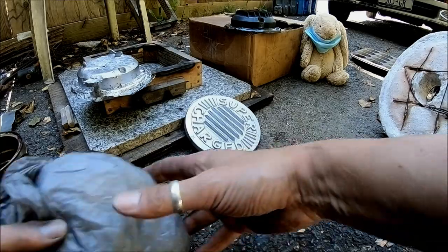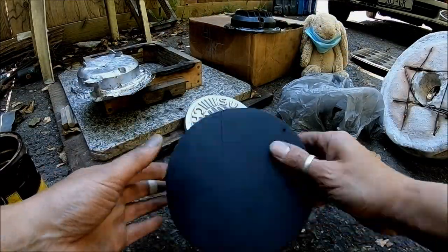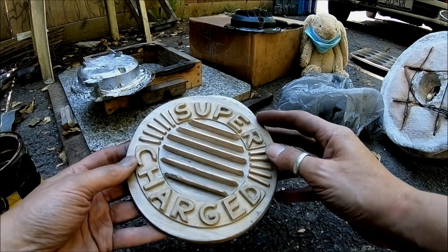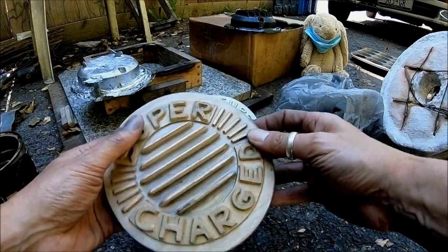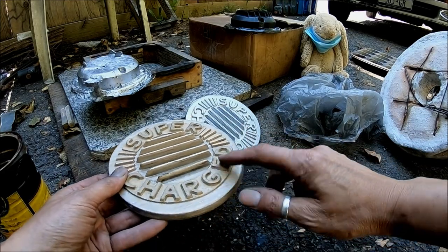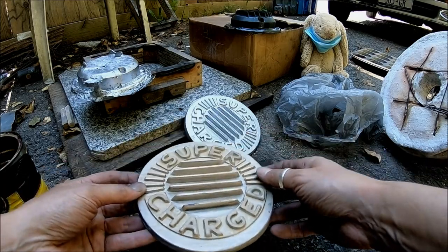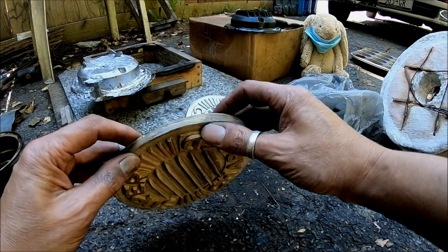That's the actual piece. Here's my pattern. It's just a simple flat pattern made out of wood, and it's been coated with some clear coat or varnish or whatever, and these letters are carved out of wood. These are all glued on, and these cooling fins are all glued on and built up out of this piece of, I think, what is it?